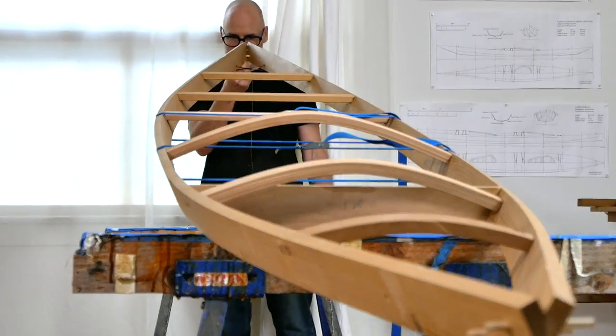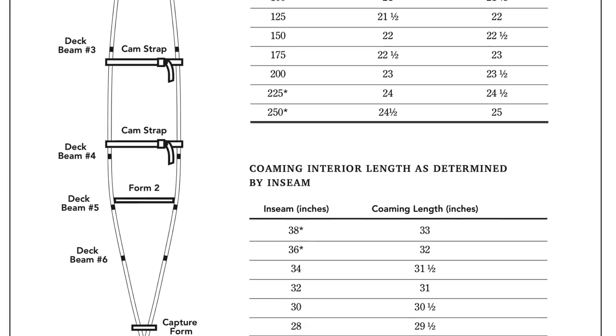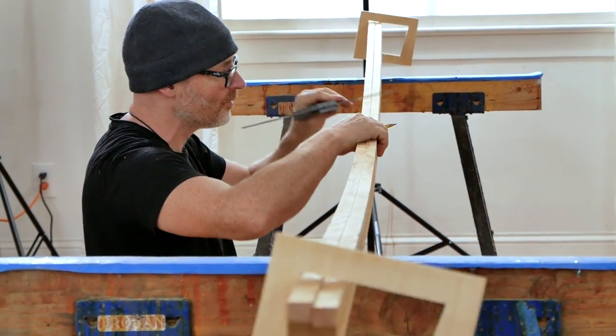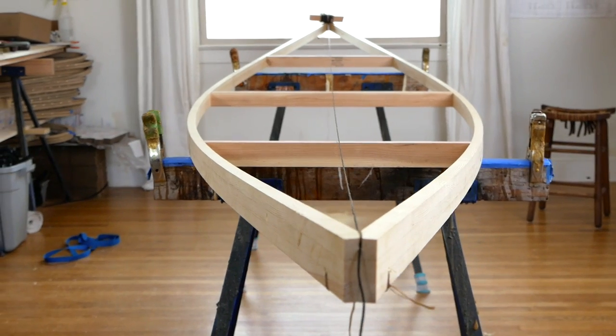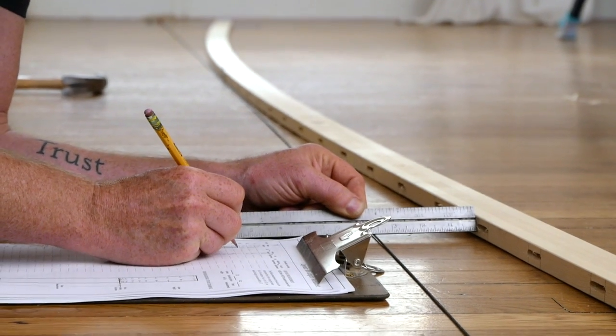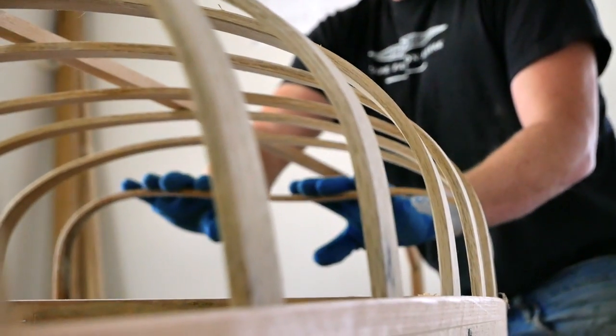The way that I came up with this building system was after 15 years of teaching people how to build skin-on-frame kayaks. I decided that I wanted to use the same ultra-efficient formula-based systems that I've always used in my kayak designs to try to build a canoe and see if we can get similar benefits. After a lengthy design process, what we came up with was a system that starts with a set of mortised and laminated gunnels — more like you'd see in a skin-on-frame kayak — and then uses a formula-based system to predetermine the rib lengths, and then we bend them in by eye.